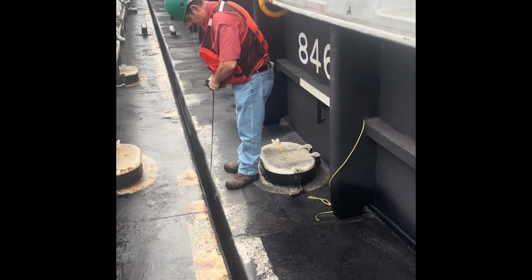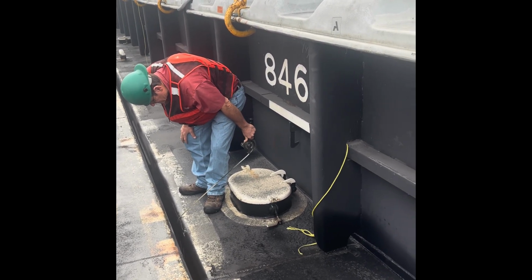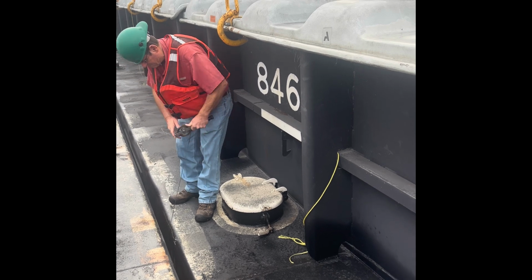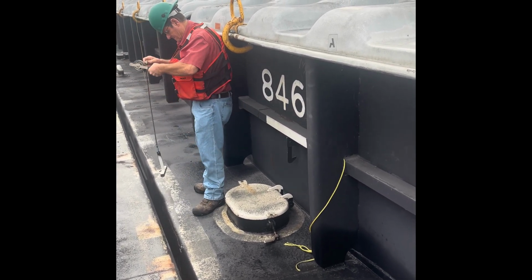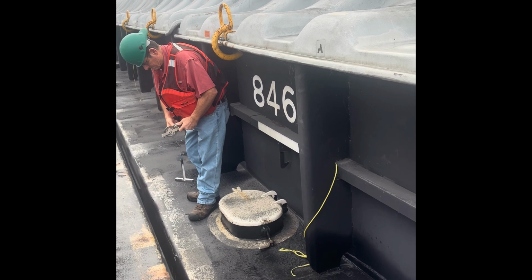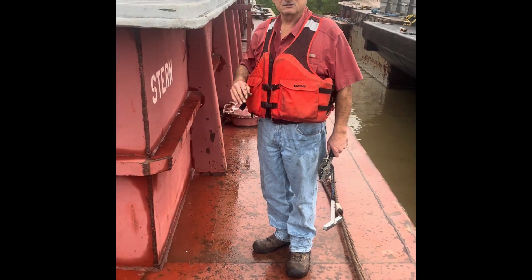For every barge we have to survey, we are to have six point reference freeboards. There will be three freeboards taken on each side, port and starboard: one at bow, one at mid, and one at aft, on each side. To gather a freeboard, a surveyor must find the draft marks welded on the side of a barge. These marks are on the bow and stern, port and starboard, and count down by feet the height of the barge.